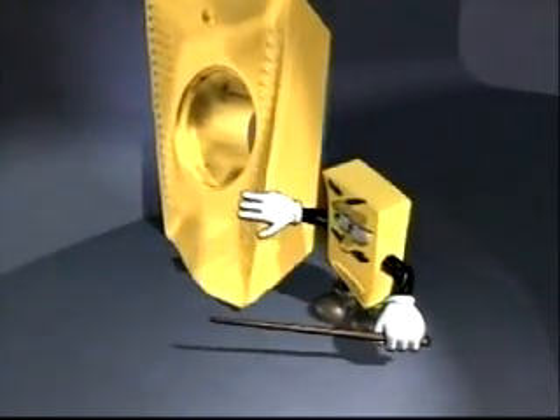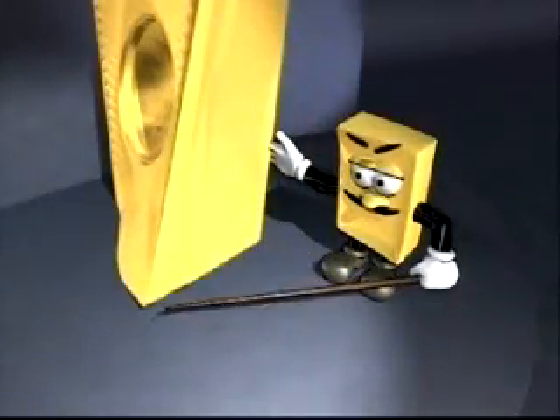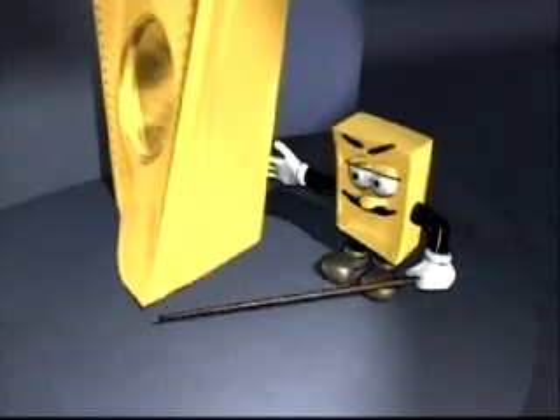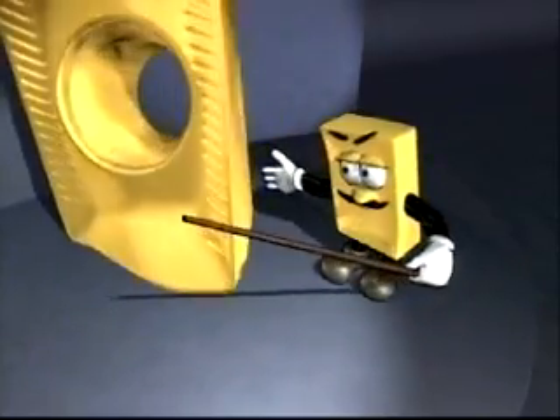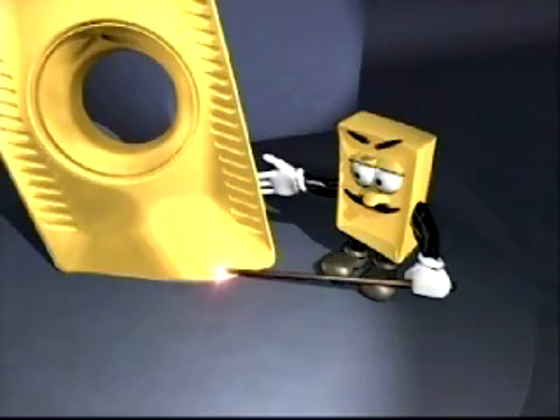The optimal cutting edges of the SuperTurbo make the cutting silent and reduce the risk of vibrations. Thickness gives the insert the strength needed for high feed while at the same time lessening the risk of breakage. The SuperTurbo also has a large wiper flat which gives a high quality surface finish.